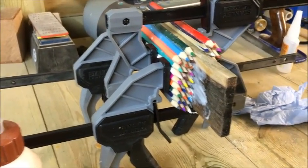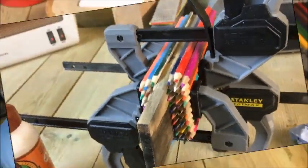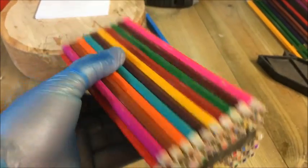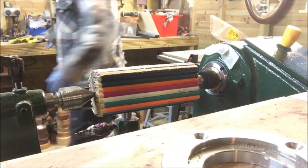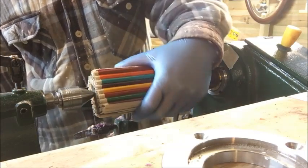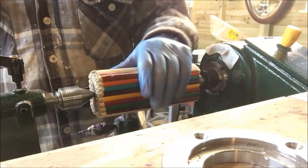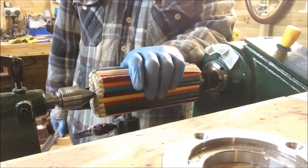These pencil projects are very delicate so you've got to be pretty careful when putting them in the lathe. I've got three layers of pencils together and you can see how tight they are — you don't really want any gaps. I have had gaps before which I sorted by putting some thin CA glue in the gaps and then filling them with sawdust. That does seem to work, so if you come across some gaps, which is fairly common, that's the solution.